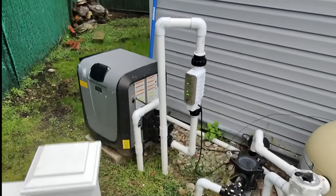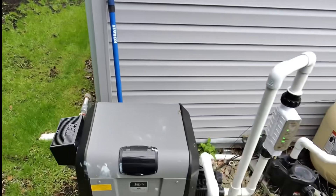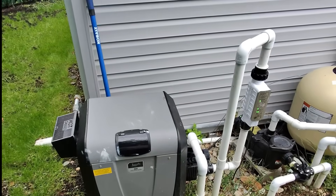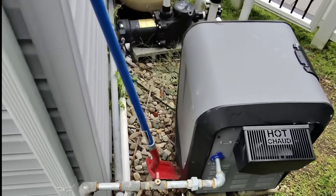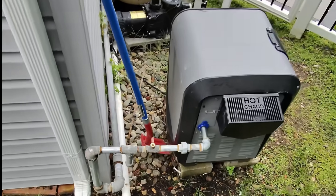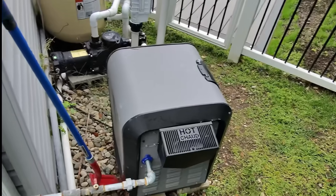Too much gas when it runs, and also it won't run if the water heater for the home domestic hot water is on. So let's take a look and see what's going on. I can see the gas cock — three-quarter inch — is in the off position. Looks like a fairly new install; they got a little sloppy with the pipe dope.